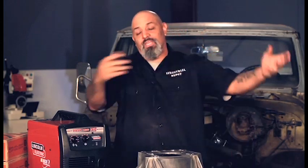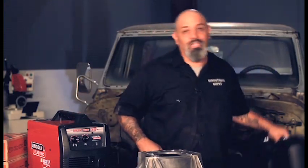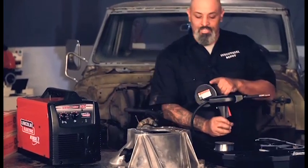The reason why you can't is aluminum is really soft, so as it's going through the sheeting it bends up, it kinks, and then you can't weld. But there is a solution — it's called the Lincoln spool gun.